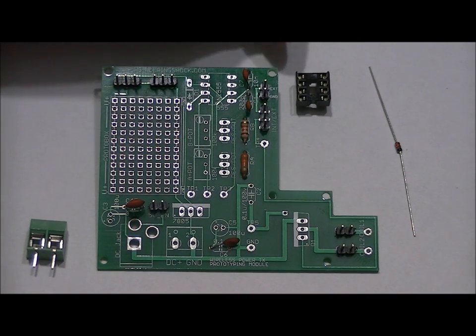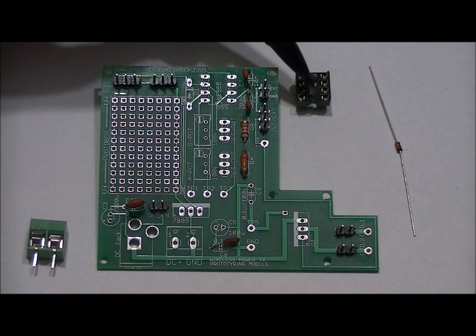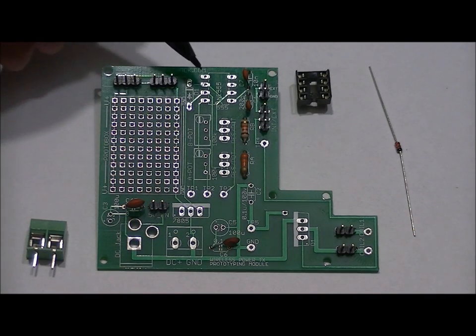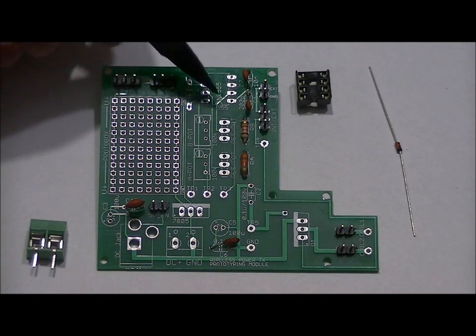This power supply input is optional — the 12-volt adapter that comes with this unit will plug directly into the 5mm jack. Solder your terminal block in, making sure you have nice healthy beads of solder on each of the leads. Now for the socket: one side has a notch at one end and the other side is completely flat. On the board labeled NE555, line up the notch on the socket with the notch on the board. If you solder it in backwards, you might end up putting the 555 in backwards.